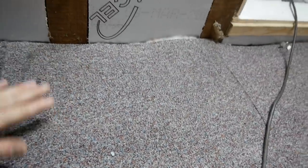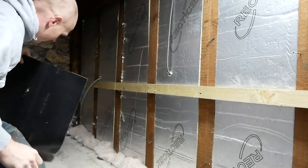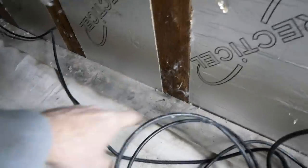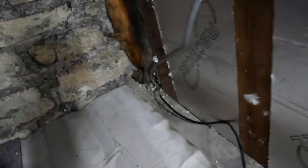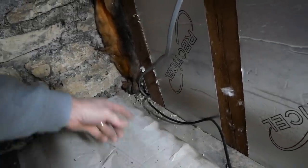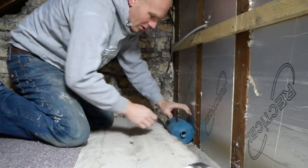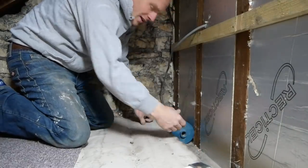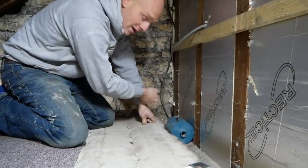Fortunately we've got 100mm of Kingspan here which was offcuts, so we should be able to lift all this out and create a space here for our pipe to run along. You can see here this is just a binder over the top of the joist — it's basically the lowest point I can go to to go through the wall. So that's the point I'm going to use as our datum and then work back. If we're using the drill riding along the top of the timber, the timber is level so that should take us through a good point.